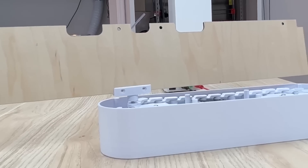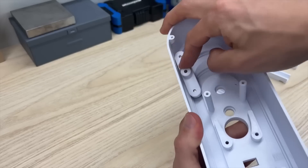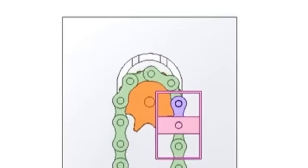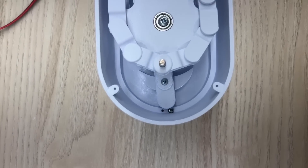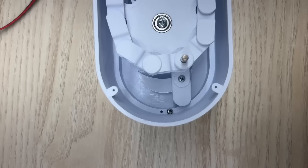But there's some real devil-in-the-details work going on here. The mechanism just kept jamming up when moving around the sprockets. But if you look closely at the animation, there's this little wiggle going on at the extremes of the motion. That's not on accident — perturbing the movement with this little screw helps it get around the horn gracefully.